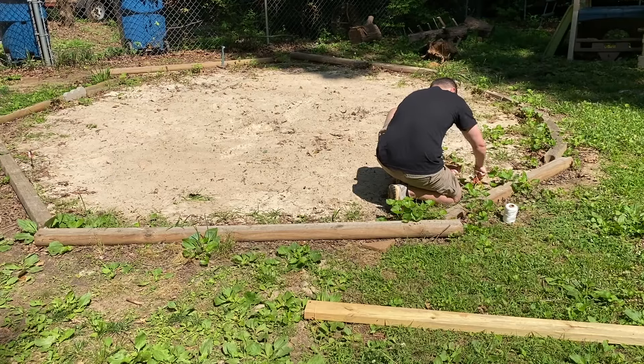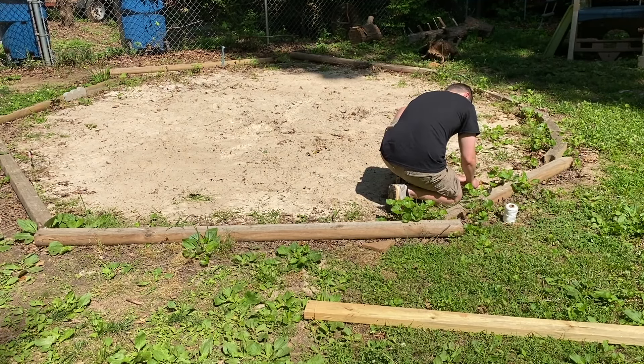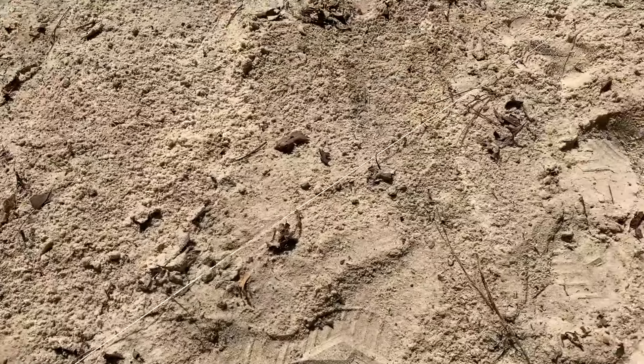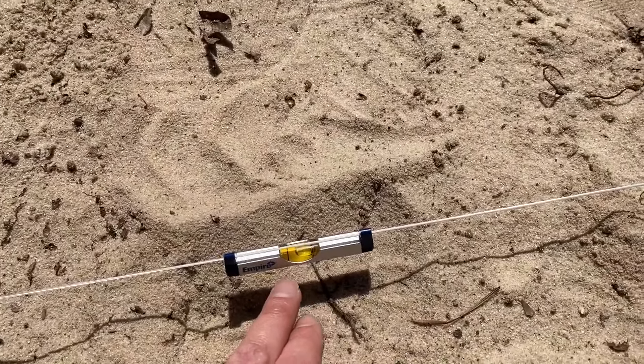In this example we are pretty close. I like to use this first because it helps you determine the coarse or large adjustment. To clarify, if your line is off the ground pretty far, you will either need to dig the high side down or add sand to the low side. I also ended up running multiple lines in this area so you can see the high and low spots and add sand or dig where needed.